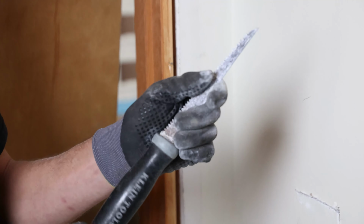The reason for that is intentional. That vanity light has been placed at a very specific location, that center and center on the vanity. That cannot move. That lands right on a 2x6 joist. I'm gonna use a pancake box, 1/2-inch thick box, that's gonna allow me to screw to the face of that joist, end up flush with drywall just like I want to, but there's a max wire fill. Max wire fill is one of these babies in that box. So I can't go in and back out. I've gotta go to the far vanity, which is gonna be 1.5-inch deep box, plenty of space, and then come back and hit the pancake. Code compliance, a little bit more effort, worth it.